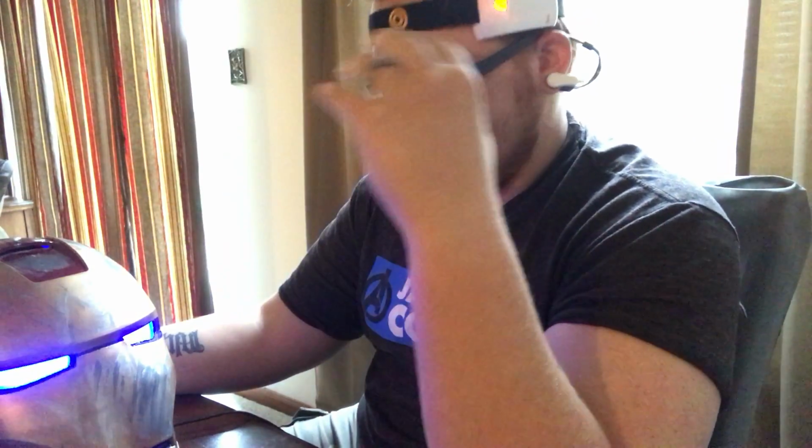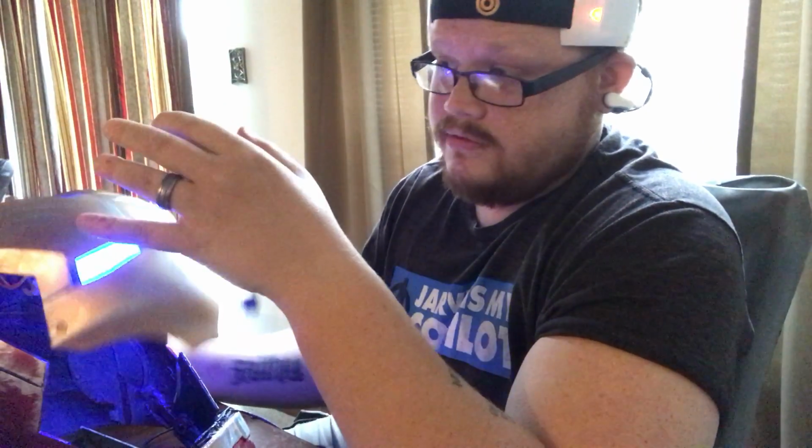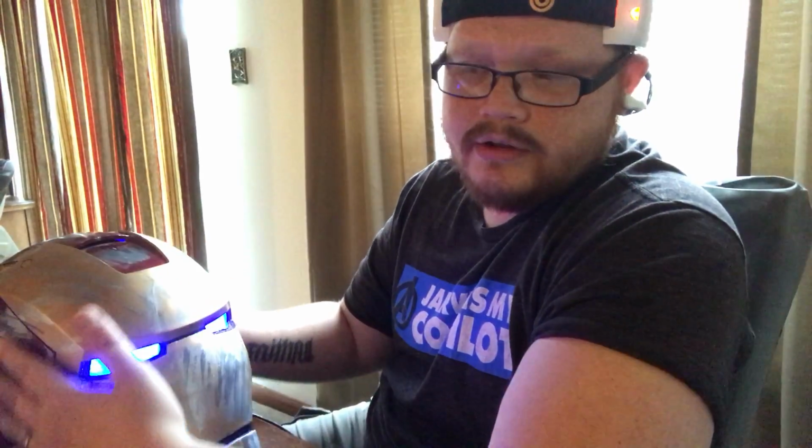Originally I wanted to be able to wear the headset inside the helmet, so I took everything out of the headset and took it down to just my needed chip and the Bluetooth. But there were power issues between the daughter board, the brainwave board, and the batteries. It didn't like the amount of voltage. It's really finicky about the amount of voltage that it takes. So I decided to leave it stock and just add the Bluetooth chip inside it. I think I went through 4 or 5 revisions of that before I finally decided to just use the stock headset. But I could literally use this setup and adapt it to anything that I wanted.